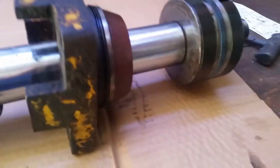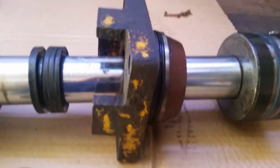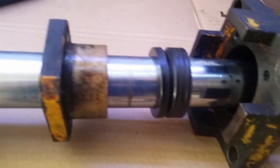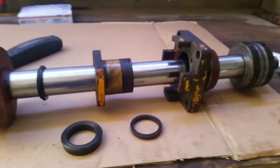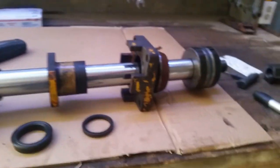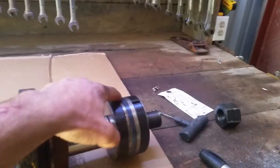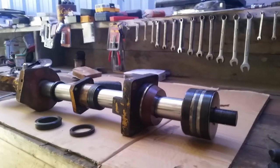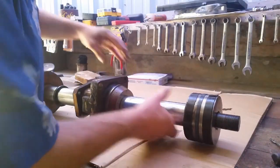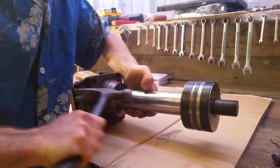We have the cylinder on the bench, so I'm going to start taking this thing apart. Already got the nut off, so this should slide off. I think this is the packing that's the suspect - this all has to be compressed together. I thought I had pulled this one apart before, but these are the old rings. I actually have two seal packs on the shelf - apparently I never repacked this one, or possibly I pulled it apart but obviously didn't replace those rings. All the new rings should be yellow, I think.